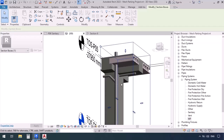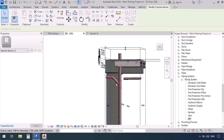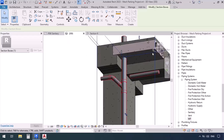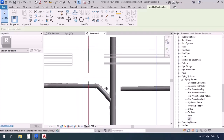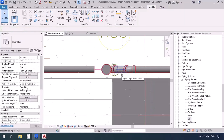Here we have a pillar and two beams connected to it. If we want to go exactly according to the plan, this junction would have to go through the beam and then go up. But we are not allowed to pierce through or change the positioning of a structural item. So let's view from the back — I've moved this pipe so it goes right beside the beam, not through it.